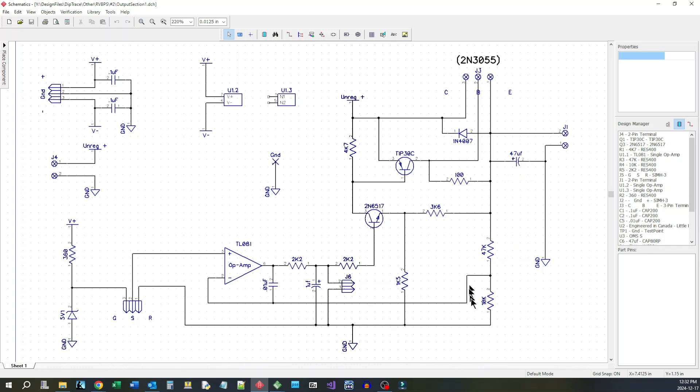This voltage divider here sets the gain of the output section — in this case it's about 5.7 to 1. That means if we have a volt coming in to the op-amp, we're going to get about 5.7 volts out. In total, since we have a reference that goes up to 5.1 volts, we get about 28 to 29 volts out of this thing maximum. We're going to beef up this output section as we go along — I'd like to get a power supply good to about 5 amps and 40 volts as our goal for now.